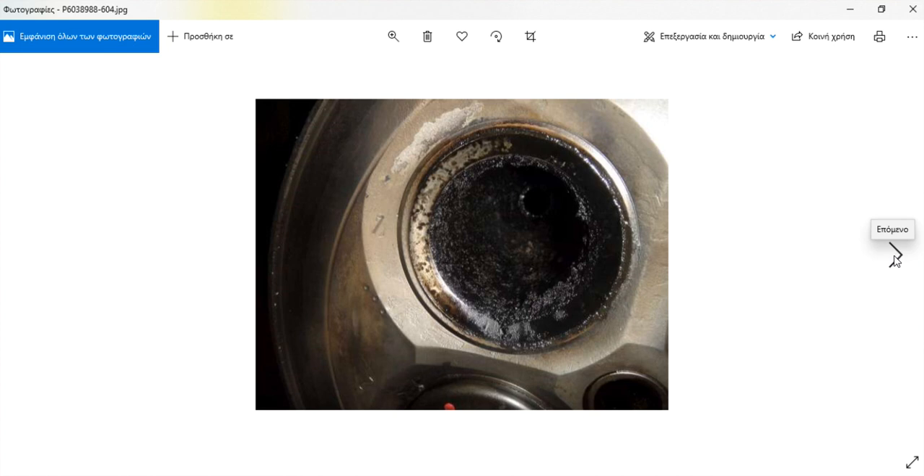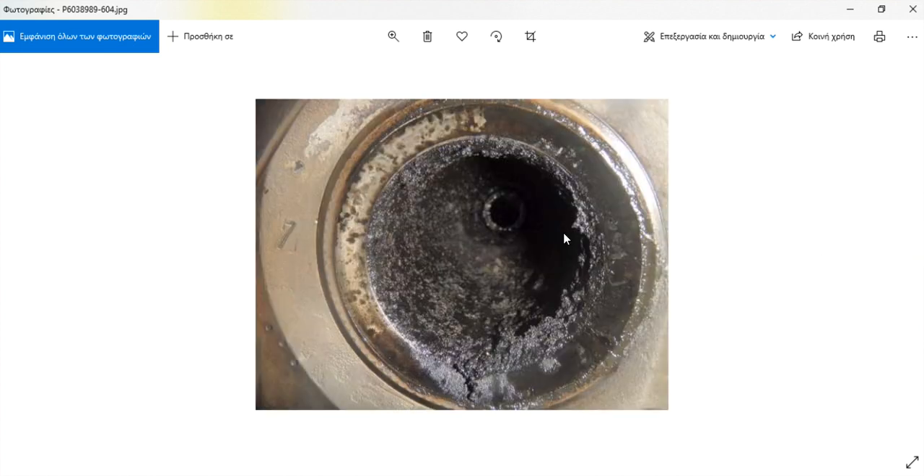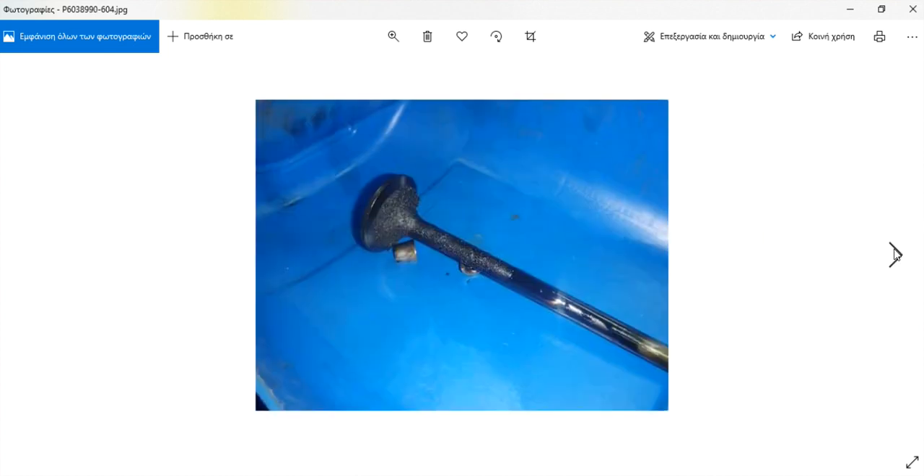This is how the valve seat looks — it is sticky. The problem that can occur is that your valve can stick inside and remain in the closed position for the next working hours. There will be a problem for sure. You can see a lot of deposits due to unburned oil building up slowly, carbonizing, and the seating face of the valve seats coming overheat due to running time under these conditions.